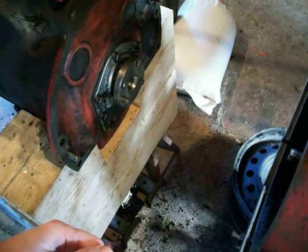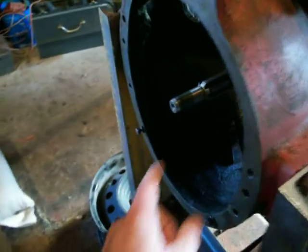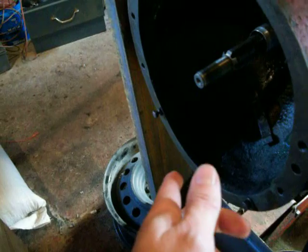Make sure to block your tires and then get in there. You're going to need to take out a whole bunch of stuff: your flywheel, your clutch pressure plate, your clutch from over here, and your pilot bushing which lives inside of there. You're also going to have to pull off the throw-out bearing carrier and the throw-out bearing.